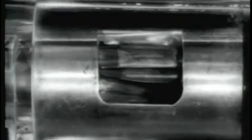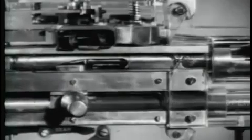The bolt locking lugs and the locking recesses of the barrel socket are at such an angle that counterclockwise rotation of the bolt during unlocking permits a slight rearward movement. The now tightly seated cartridge case is loosened in the chamber. This prevents the extractor from tearing through or slipping over the head of the cartridge case. The operating rod overcomes the resistance of the bolt. Unlocking is completed. Extracting and ejecting now begin.